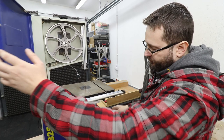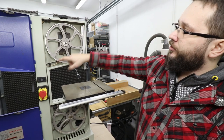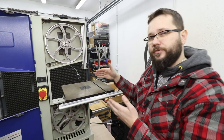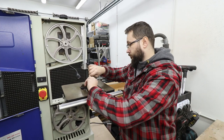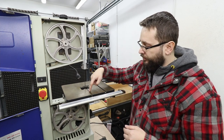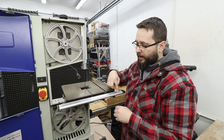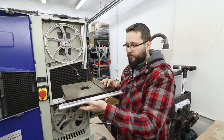Let's open the compartments of the wheels at the top and at the bottom. As you can see, the tension of the blade is there, so we need to release the tension — in my case it's a knob at the top of the machine. The next thing is to remove the clearing plate. In my particular case I've got a groove in my table at the front, so I can remove the blade by pulling it through. But first I need to remove the straight edge, which is my locking edge for the fence, so I need to remove that first.